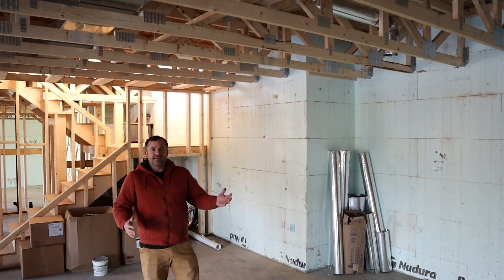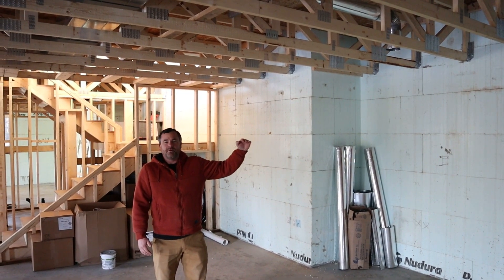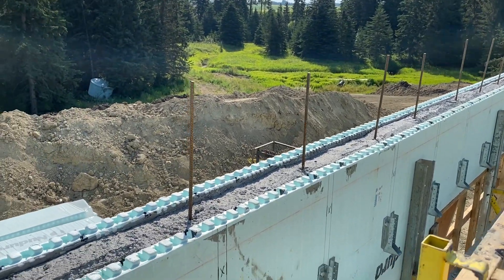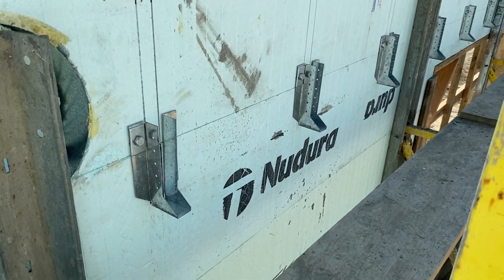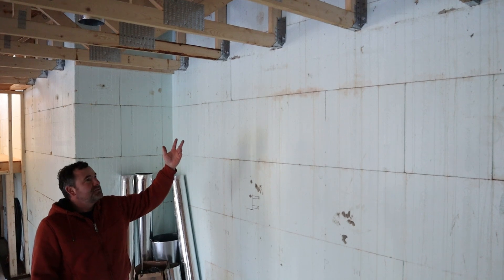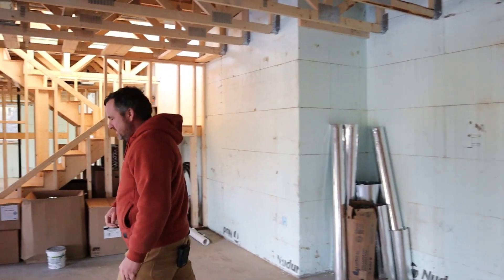Normally, if you're pouring a basement, you pour it in a conventional method and stop where the basement ends. But for a house like this, you just pour up and stack the block a little bit taller. We insert these hangers, and when you pour the concrete it encapsulates those — now you can set your floor joist system.